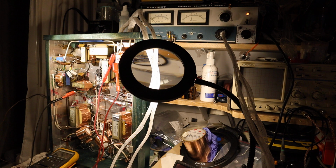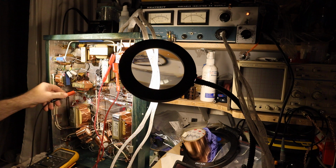There's the specification of all vacuum tubes to keep the voltage within 5% of that expected value. If you are keeping it at the value or a little bit lower to the minus 5%, it's going to live longer. If you keep it higher than the rated voltage, then your tube will live shorter and shorter. And if it's like plus 10% or plus 15 or plus 20%, then your tube will have a very short life. So we want to prevent that at all cost.